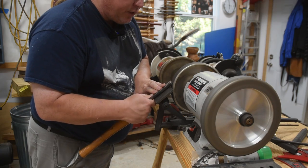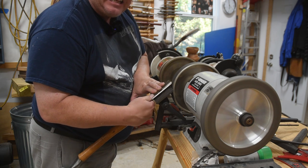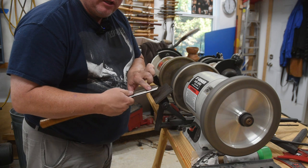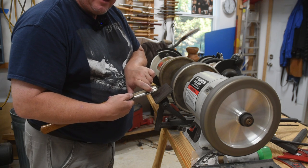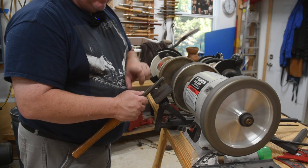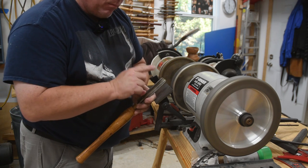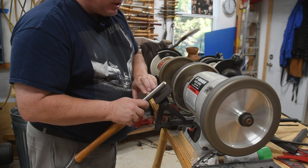One really cool thing about CBN wheels is that they're metal wheels — they act as a heat sink into themselves. I can grind like this for quite a bit of time without it getting too hot. My finger is still touching it and I am not burning myself — it's a little warm but not bad. If you're using a friable wheel, all the heat goes into the steel, not the wheel itself, so you might need something to cool it off. But high-speed steel can get way hot — well beyond turning colors — before it's going to lose its temper, so you don't really have to worry that much about it.